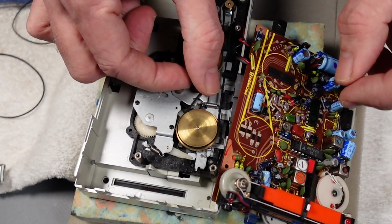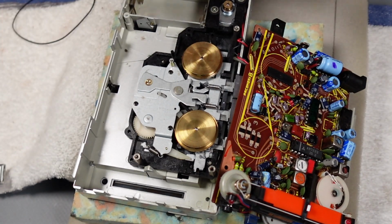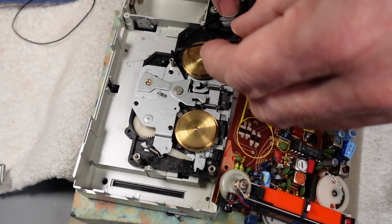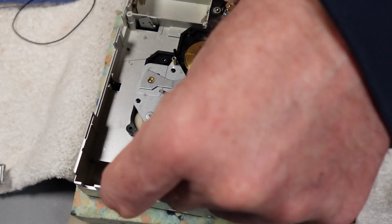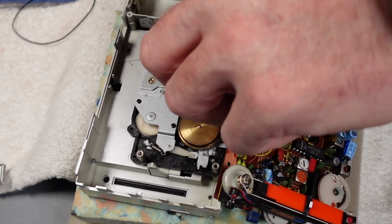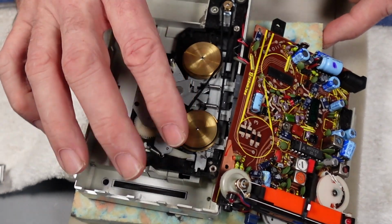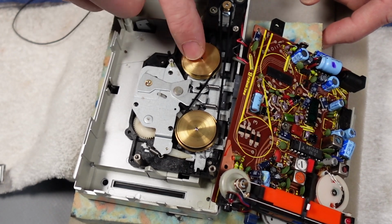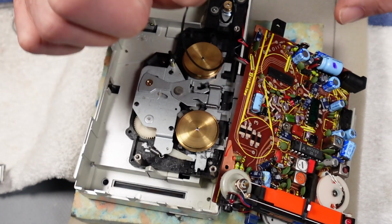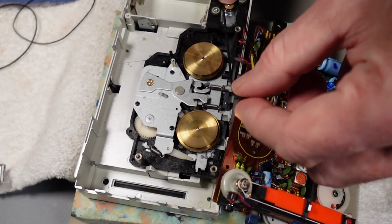Now if I go for a 70mm, and to be honest, the original one's reading about 0.9 actually in thickness, so we probably would get away, as it were, with a 1mm. See, that one's slipping. See, that one's not quite biting. So we know that 70 is too big. So this one here that's about 67 is about right.